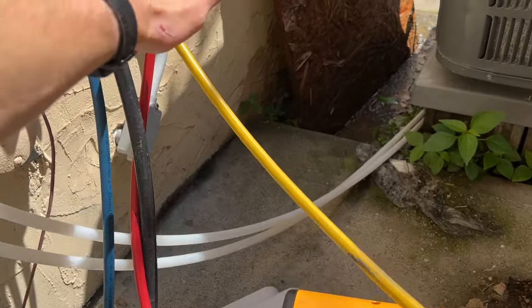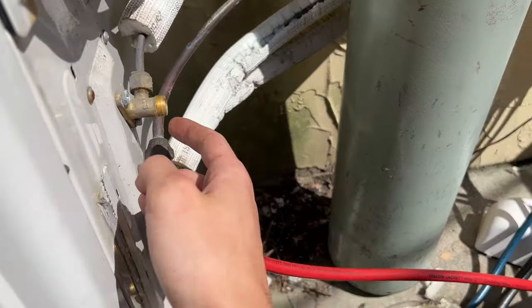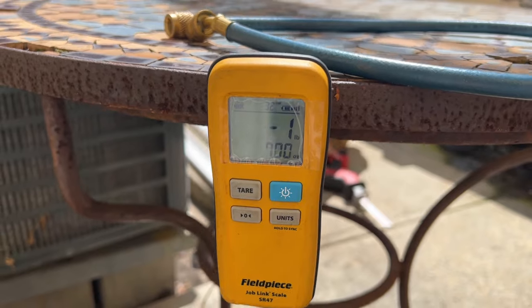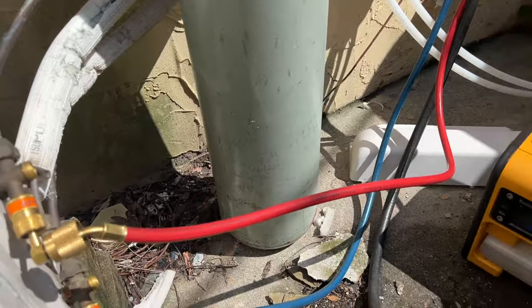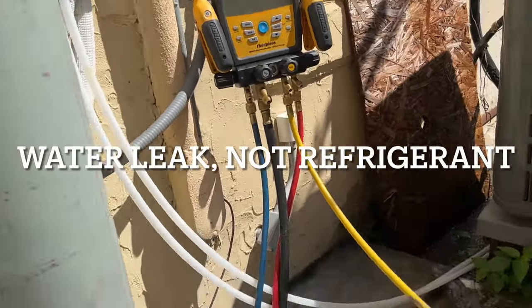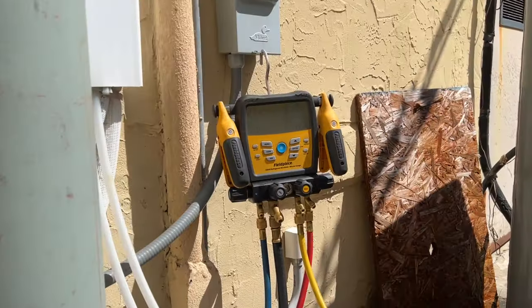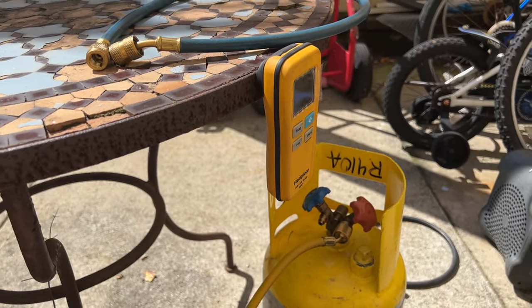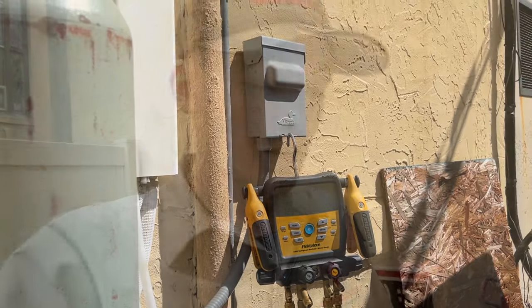I purged my yellow hose while the others were still under vacuum — actually I added pressure — and I opened up these valves. I'm adding the two pounds two ounces that we took out. We also have a newly developed leak inside, and I think it's just because the system's been off. Water may have accumulated and it wasn't able to pump out. At two pounds two ounces, maybe another ounce or two for loss, but should be okay there. We'll hopefully get them kicked back on and everything works okay.